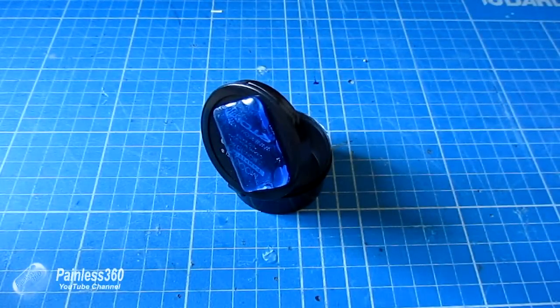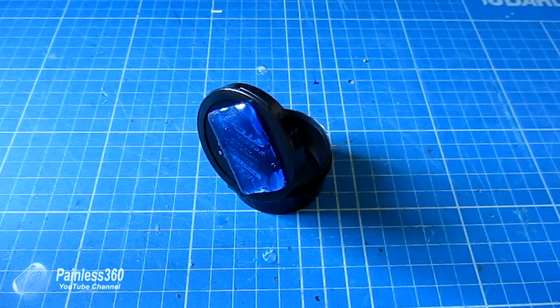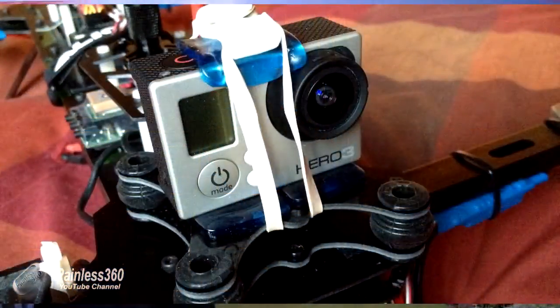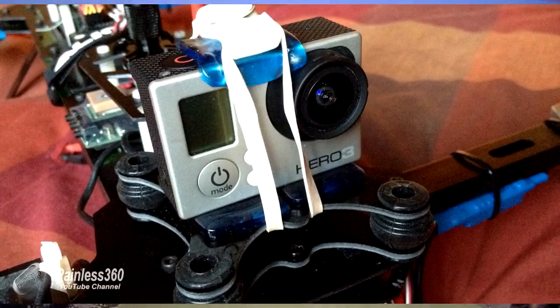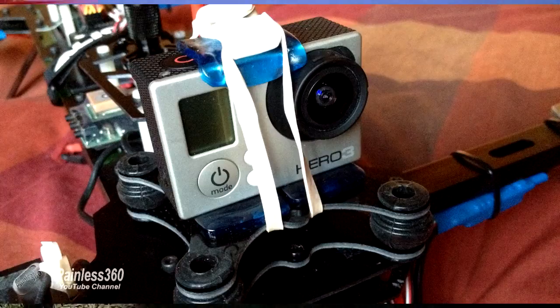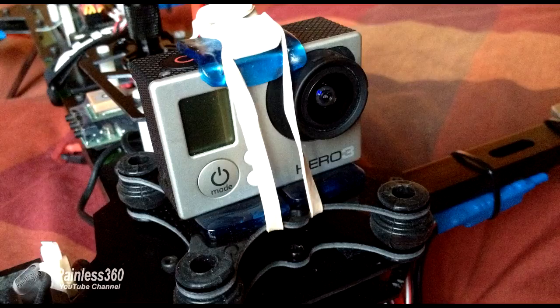Now, interestingly, even in my big H-quad that I use for aerial video bits and pieces, I still mount the camera on a couple of pads of MoonGel because it helps reduce that final little bit of video jelly that you get when maybe the props start vibrating synchronously on the chassis. So in my builds now, I'm starting to use MoonGel on almost everything to try and isolate the camera.